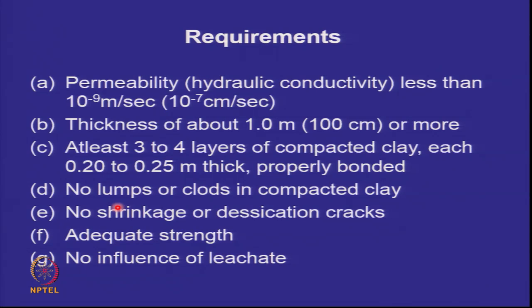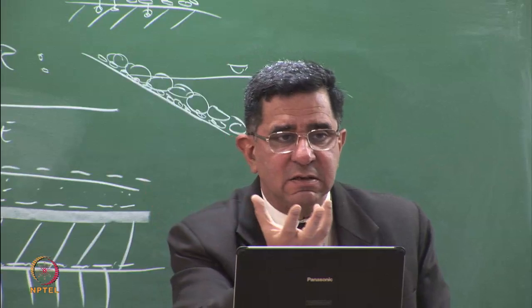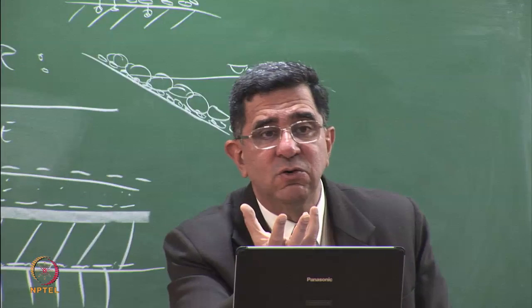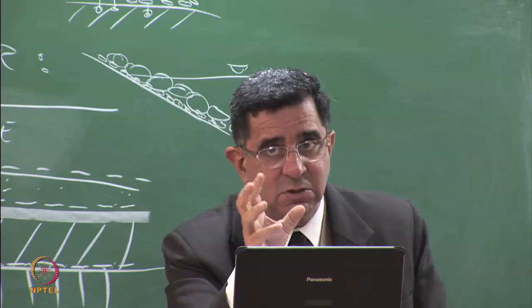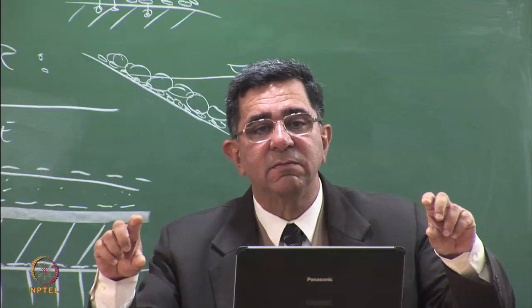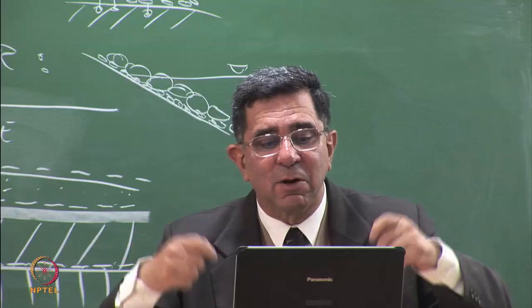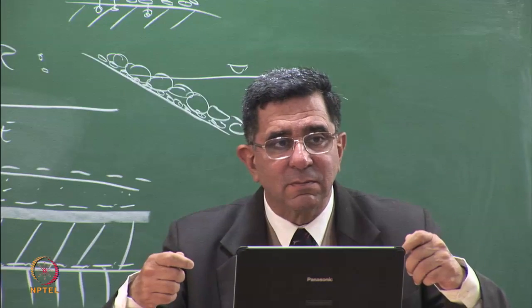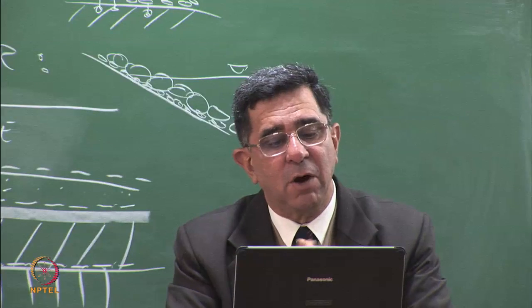The main issue is, you should have no lumps or clods. When you excavate clay, it is plastic. When it's plastic, you get clod size. And if you use a smooth steel drum roller, it is not going to break up that clod, especially if you are using a thick layer. So, by using 8 inches of layer and using a sheep's foot roller, you are breaking up the clods. And therefore, after that, you can do the compaction properly.